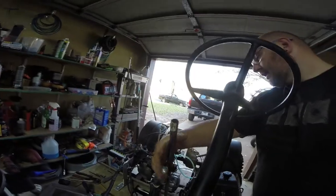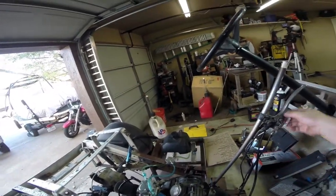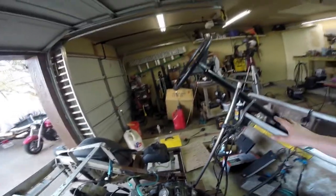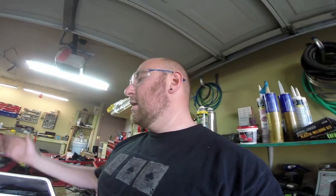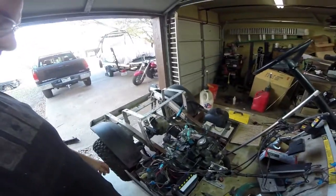This is our clutch. Let me bring you around to the other side — the clutch is hooked up. It's down here, and you can see when I pull it up, the clutch works. I also connected this right here — this is the parking brake assembly. This gives us a second mechanical parking brake if the hydraulics aren't holding. Generally disc brakes have a bleed-off, unlike drum brakes, so the hydraulic pressure may not hold after like five or six minutes, but this will always hold, which is why we used the rear caliper. We could wire up the clutch switch and the parking brake switch if needed, but I think I've already bypassed at least one of those, so we'll probably just yank those switches out. That's basically the last major system.